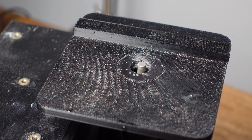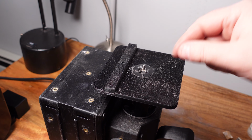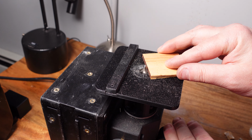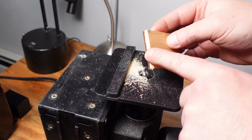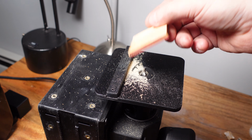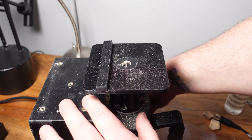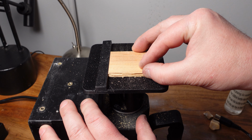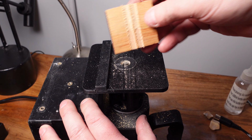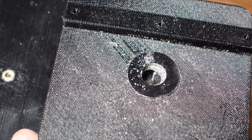So this is useful. You can also use it as a router. Here I have a Dremel router bit. It rounds the edge. There's all different Dremel router bits, different shapes, and here's a slotting bit. You can put slots in wood. Take a metal bit for cutting sheet metal.